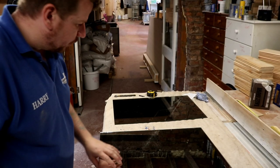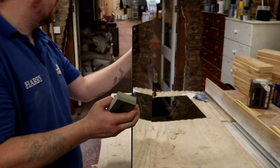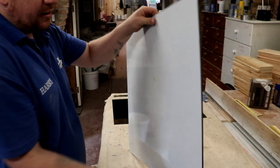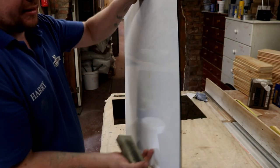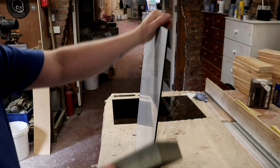We're going to do something similar to this so that nobody cuts their fingers on it whilst it's installed at home. A really convenient tool for taking the sharp edge off a piece of cut mirror — or any glass for that matter — is a good old two-tone sharpening stone. It works a treat. You can use the rough side initially, and it's best to run up and down the glass instead of side to side. If you go side to side, you could put some stresses on it or cause what's known as shelling, where you get little half-moon shells crack out of the edge.